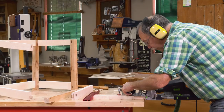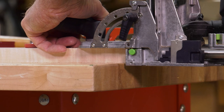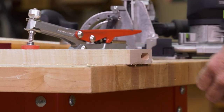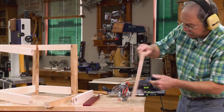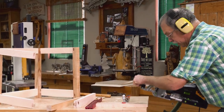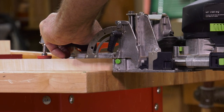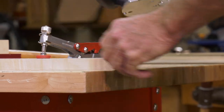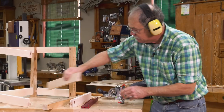I bring that up against that first stop, hold the fence flat to it, and make the cut. That's in 30 millimeters, which is what I want. On the high side, because this is going to get an arch in a second, I just flip it around on the other end. Because this cutter is set up right on center, I can flip it and it stays centered up. You can see those are inset exactly the same way — that's perfect.